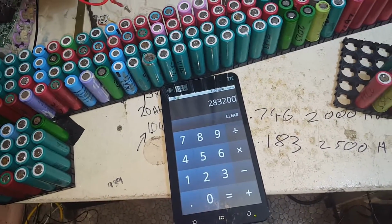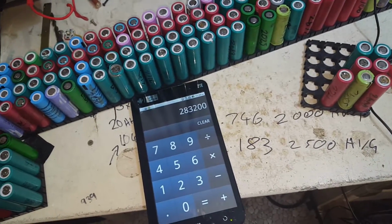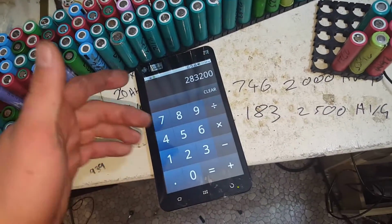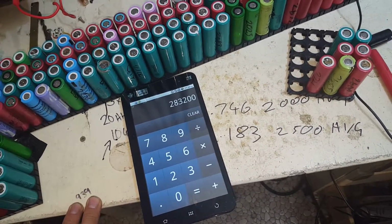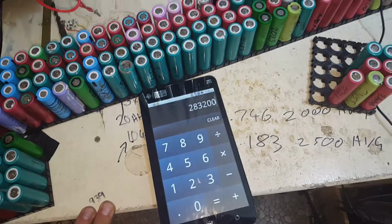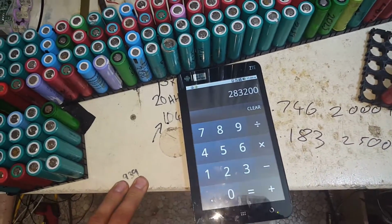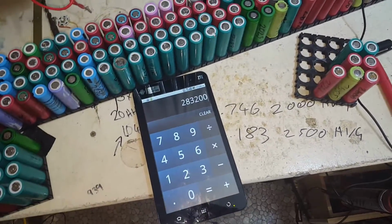So just removing the engine and transmission, fuel system, exhaust, radiator, all that. We've been re-adding 40 kilowatt of batteries, controller, some wiring, and a 100 kilowatt DC motor. You know, we're not going to be altering the vehicle's weight tremendously, but what we will be doing is positioning the weight differently to the way it is at the moment.